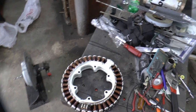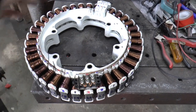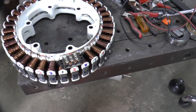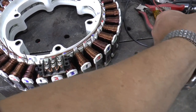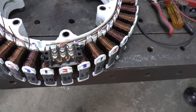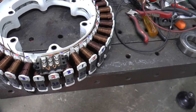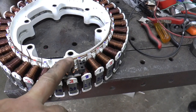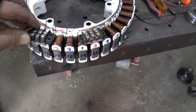This one has the aluminum windings and this is what I came up with. I'm going to cut it in half, starting there — I've got them all numbered, this is the halfway point. I've got these terminal blocks because you can't solder aluminum wire, so I thought if I put them under a screw and make my other connections on the other end of the screw, I think I'll be all right. I've got double-sided tape on the back side and zip ties — seems to be a good solid setup.